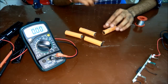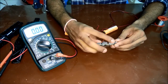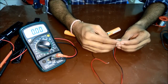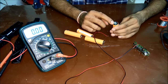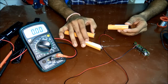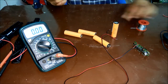I'll use a power bank circuit from my old power bank, which has three output USB pins. I've soldered extra wires so I can connect to the batteries easily. It will be charged from the mini USB pin. I'll connect positive to positive and negative to negative. The positive pin is the one with extra insulation and a shorter pin. For some reason these batteries don't have plus/minus markings or any branding.